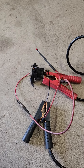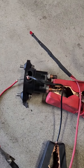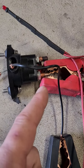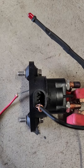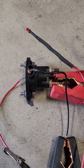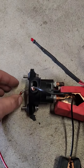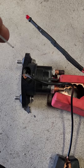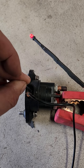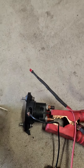Testing the starter solenoid on a 2011 250 horsepower Evinrude E-TEC. There's an LED light that comes on with 12 volts — positive on one terminal. Inside there's a harness connection: the purple wire on top, the brown wire with white stripe on bottom. Negative on bottom, positive on top. When it completes the circuit, it puts 12 volts to that light and the light will come on — so that's good.